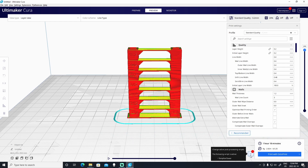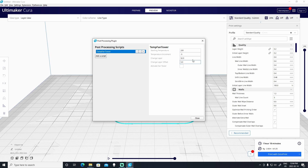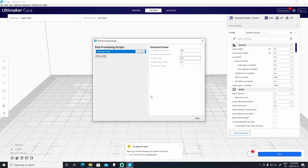So we go back to the script and change it according to what we figured out. The starting temperature is going to be 220 degrees — that's fine. We're going to subtract five degrees every 41 layers, so after 220 it's going to print at 215, 210, 205, et cetera. Now the change layer option is what we need to fix. Here it says it's going to change the temperature every 52 layers, but we've determined it's going to be every 41 layers for our particular temperature tower. So we put 41 here, and the change layer offset is 5 because the base is made up of four layers but it will change on the fifth layer. So we leave the change layer offset at 5.